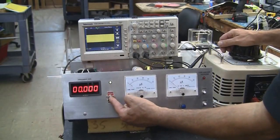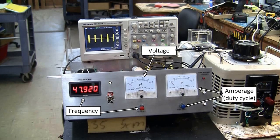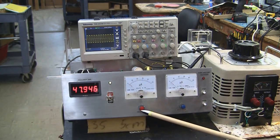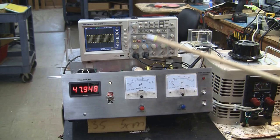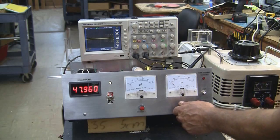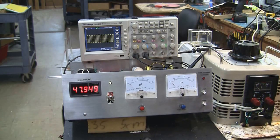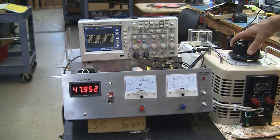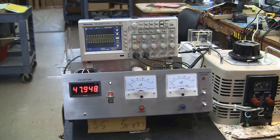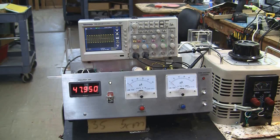Power on. This is your frequency readout in kilohertz and your duty cycle over here. This gives you your power control. Your voltage — that variac right there — controls the power into the final amplifier. The driver circuit power supply is totally isolated. The minute you turn the switch on, your driver is fully energized, but with the variac turned down to zero you have nothing going into the final amplifier.